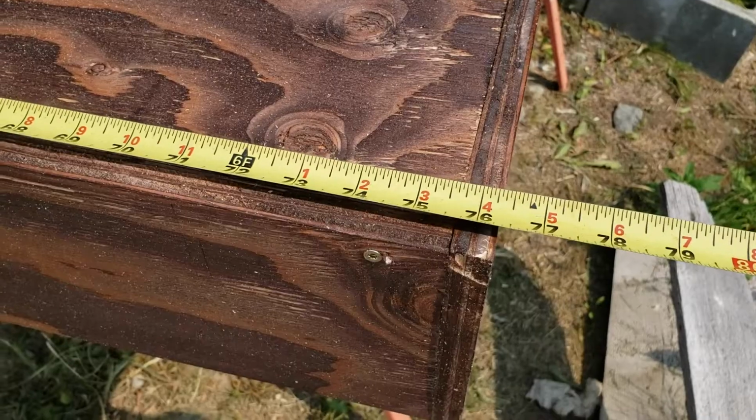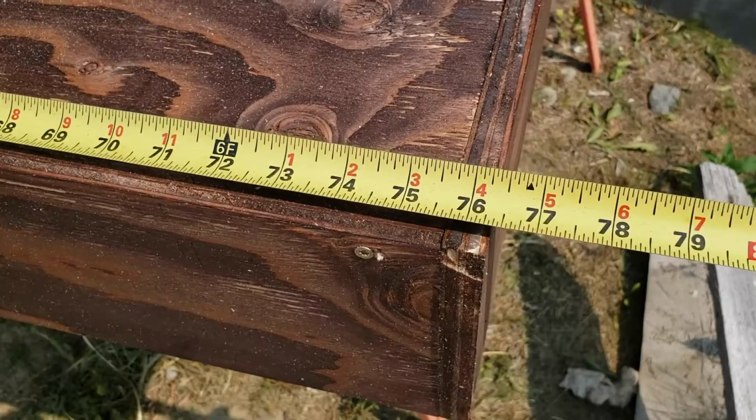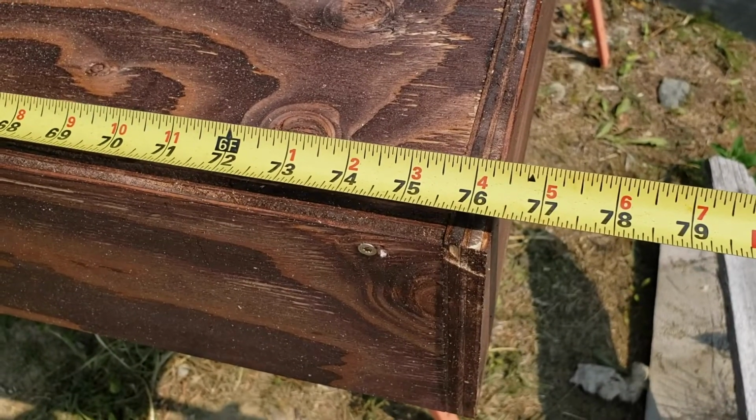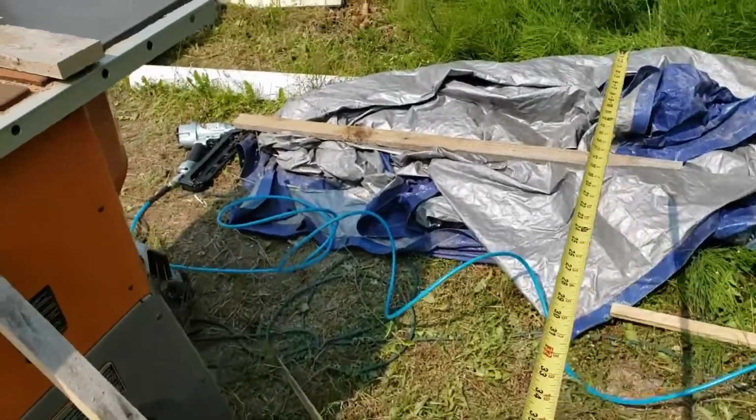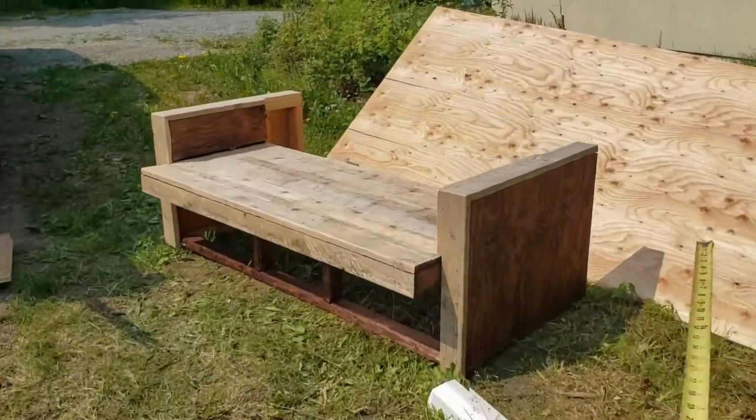I'm gonna go ahead and add 1/2 inch. If that's not enough, I may have to raise a little bit more. So my bed is 76 3/8. I'm going to go 77 for my supports, plus the 15 extra to sit down inside the sofa frame.